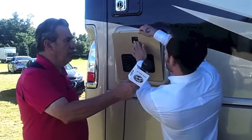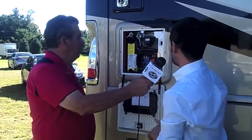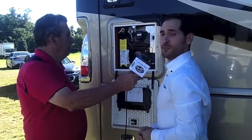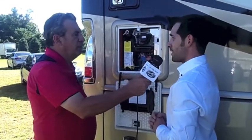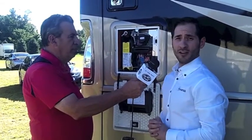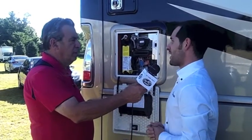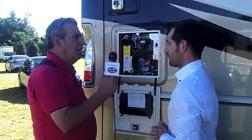We have a nice little clip here, which means we don't have to scratch the paint up anymore. And when it folds down, we've got all the guts right there. We've got the temperature stabilizing mixing vessel, which makes the unit a true hybrid. It allows for a buffered out, consistent water temperature. We have the highest capacity burner on the market — it's 60,000 BTUs, and it's actually variable. So it steps down to 20,000, and whatever the demand is, it's going to find the lowest amount of BTUs required to satisfy it.